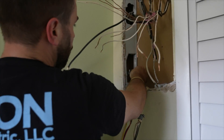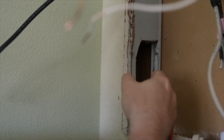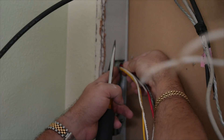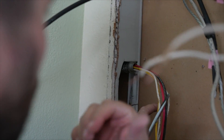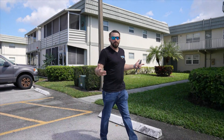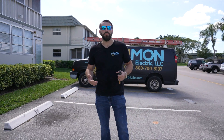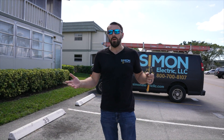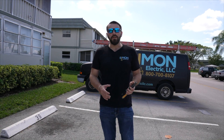This old male adapter used to come into the panel perpendicular to the side wall, but since it's a pipe going down this wall we rotated it up so now it's perpendicular again to the wall of the panel, making a nice connection in a more convenient location where it penetrates into the side of the new panel. Thanks for watching — another project, another completion, another satisfied customer. This is something important and satisfying to do: you come into an antiquated old system, replace it, and it's nice and shiny and new, and you know for a fact that for many years to come that customer is going to feel safe. Stay tuned to the next one — take care, guys.